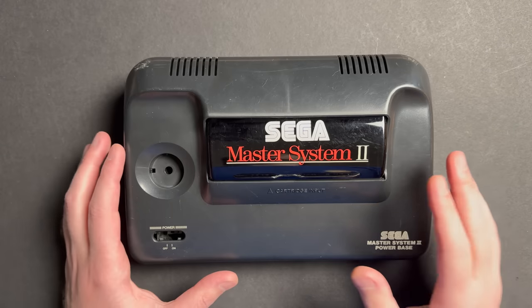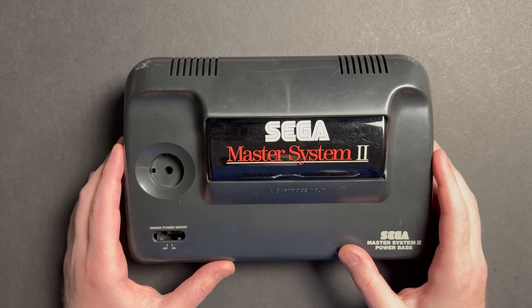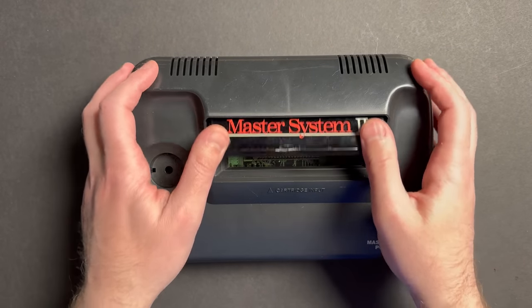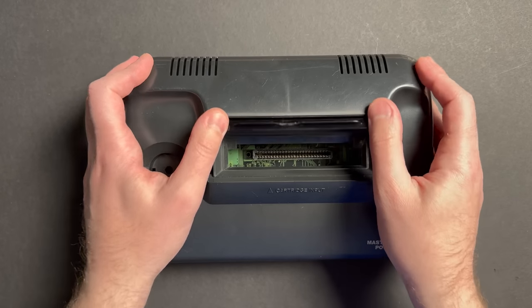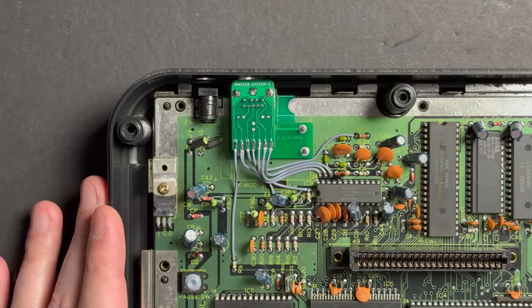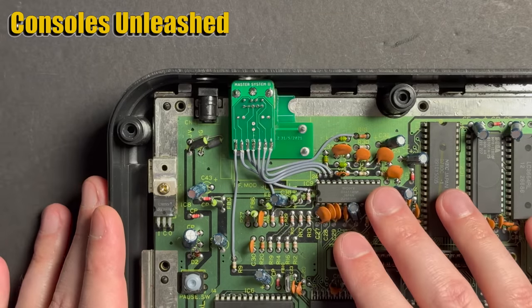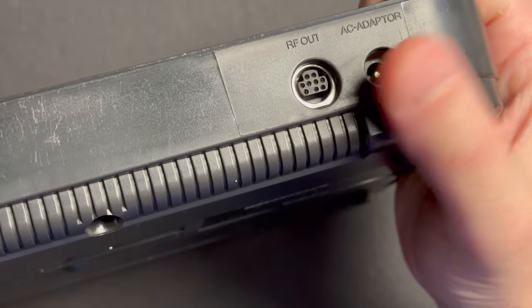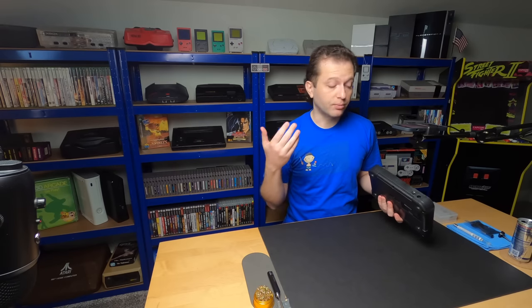We are back and the modding journey continues on my Sega Master System Model 2. We're pretty much where we left off last time. The case is looking a lot cleaner - it's no longer making that hideous screeching noise when you open and close the cartridge hood. What we did last time was install the passive RGB kit from Consoles Unleashed, and in doing so we now have this gorgeous 9-pin DIN on the back where the RF jack used to be. The system can now output both composite video and RGB using your Genesis Model 2 style cables.